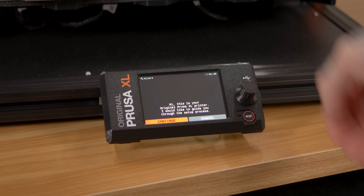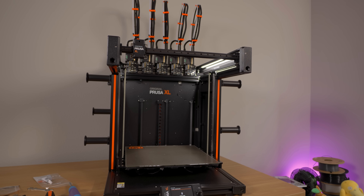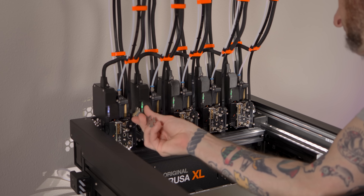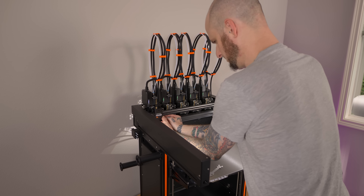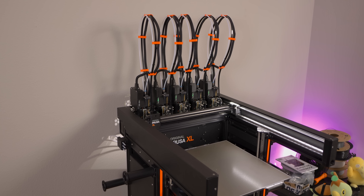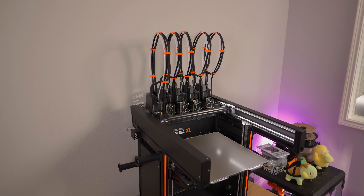Which brings us to calibration. You've got your typical self-check things like checking the hot end heaters and fans for each of the hot ends, but then we go on to a more manual and in-depth process specific to each machine as it is assembled. With a tool changer, it needs to know exactly where each of the tool heads is so it can align each of them up to each other. That's what we need to help calibrate, guided through the wizard on the screen. It's pretty straightforward to manually align the carriage to the tool head the first time so it can home, know where the dock location is, do a quick test — dock, undock, dock, undock — and ensure everything is working properly. That's repeated for all of the tool heads.